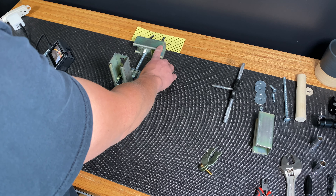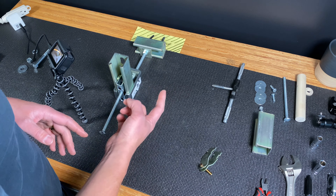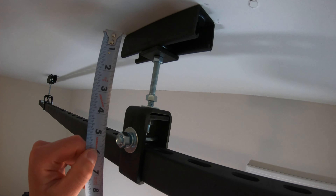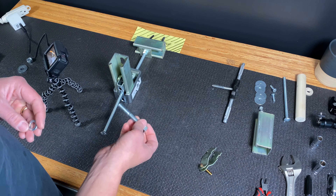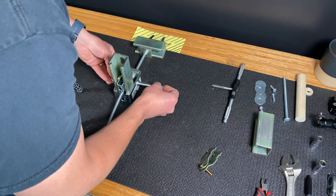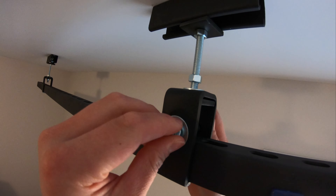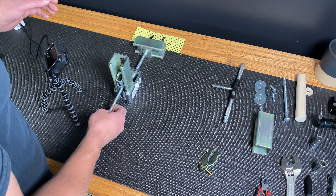You may be asking why the trolley simply can't run in the strut attached to the ceiling — and that's because I have two obstructions on my ceiling. The first is a light fixture in the center of the room, and second I'm going to be adding acoustic panels. So I had to place this gap so that the system can slide freely across my entire space. Lastly, the main strut will be secured in place by this bolt, completing the assembly of the track system.